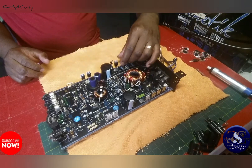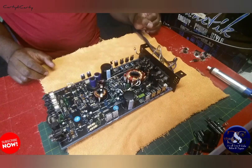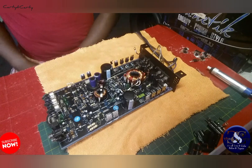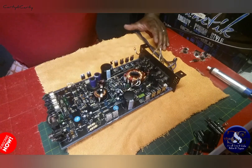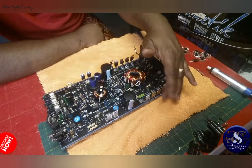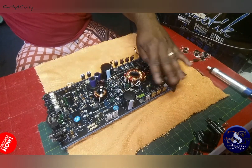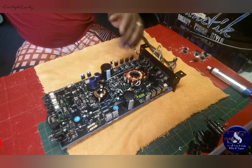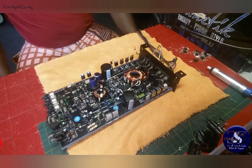I replaced these six power supply MOSFETs, which is the CS50N06. When I powered it on earlier, I found that all of them blew out — not exactly all, but one side blew completely and one MOSFET on one side. So I had to reinstall fresh ones again and then figure out what was causing the problem.